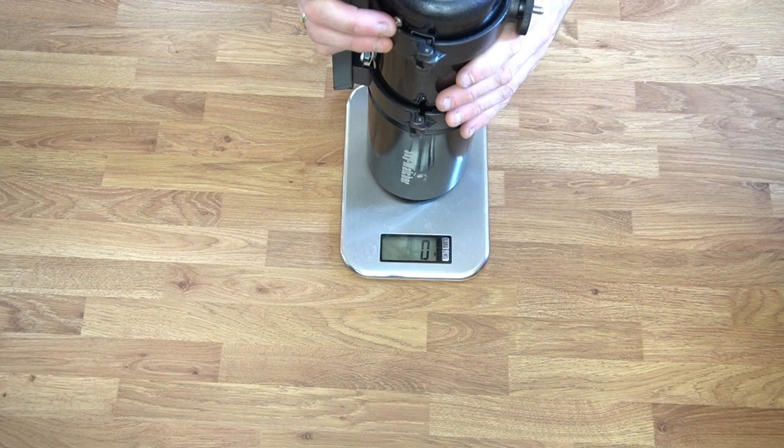There's a locking mechanism. If you adjust that and then try to turn it, you can see I can't turn it either way. So it's very rigid. That bit of grease will help lubricate that sleeve and prevent the screws from damaging it as well, because it was literally bone dry. I was a bit miffed because I had a bit of free play, and there was actually quite a bit of slop. But as you can see, I've adjusted them and now they are tight.